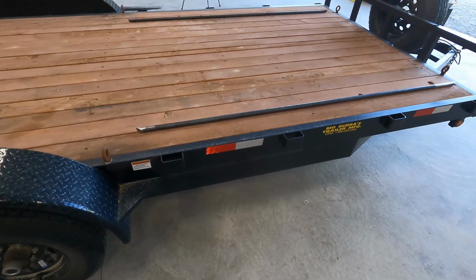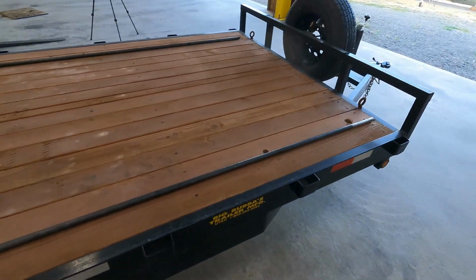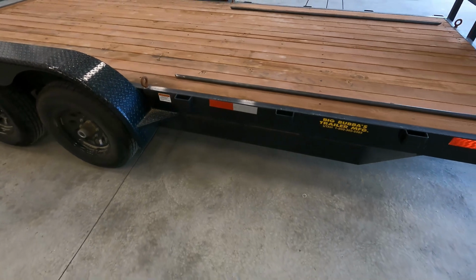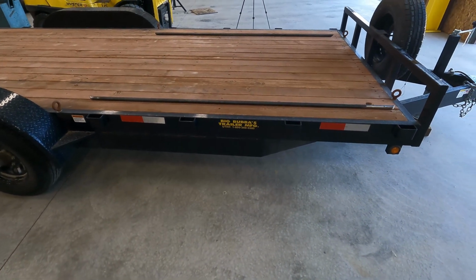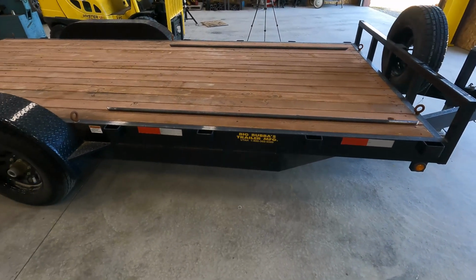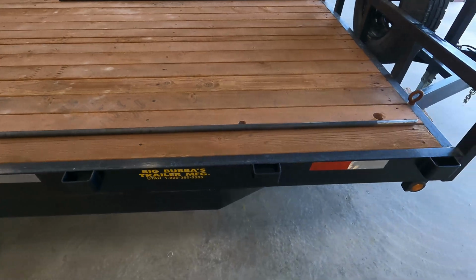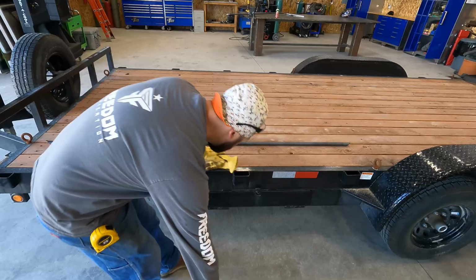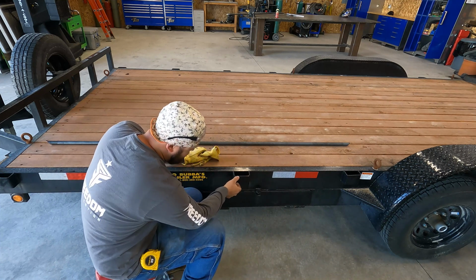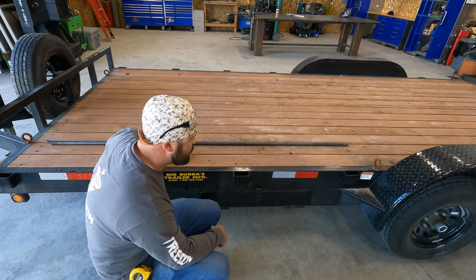It's just I guess a quick lesson on measuring all the spaces that you need to make modifications to, because they're not always going to be the same. Anyway, we'll get this one over in the saw, chop off a couple inches. Looks like I need to chop off like 4 or 5 inches, get it back over here, and then we're ready to start grinding on these pockets and getting them all cleaned up, ready to tack up there. Let's do it. Okay, so we're just going to buff the paint off on like the top 1.5 inches on every one of these pockets, and then we'll be ready to tack it on.